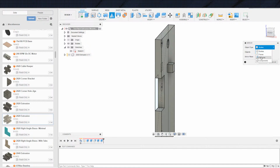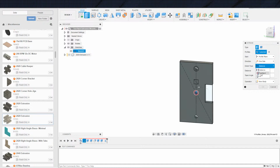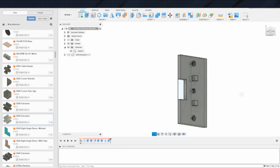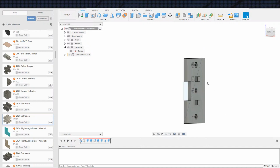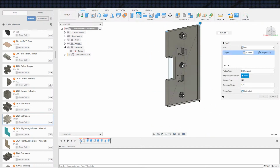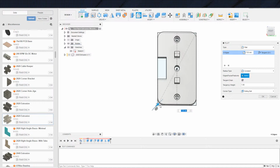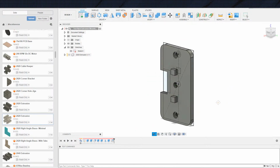All these guys. Features. And this guy can just go straight through because he's getting tapped. And again, I'll put some thread lock on that to make sure it doesn't go anywhere. I just have blue thread lock, so it's not a problem if I have to take it apart. It's just there so that it doesn't shake loose, rattle loose, vibrate loose, whatever adjective we want to use. It's not there to make sure it never comes apart. We're going to call this, I guess, 7 for right now. And then I'll come back and print that out afterwards. And like I said, we're done here.